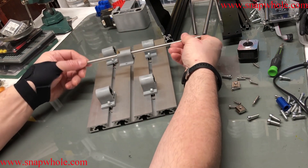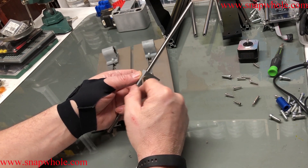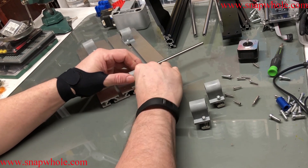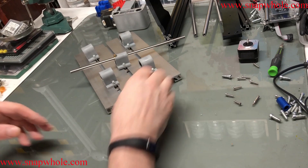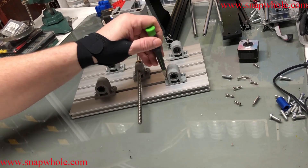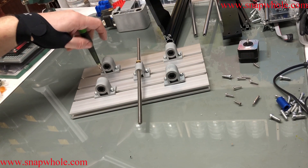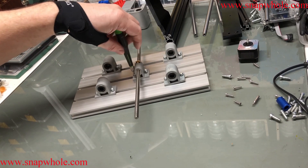I'm going to thread the drive screw to about the middle. I made a mistake putting two nuts on before threading — learn from that. I'll fit these back on. None of these are tight yet and I don't want to tighten them fully. I'll just tighten one screw on each so they don't fall off, since attaching them properly requires jumping around between parts a bit.